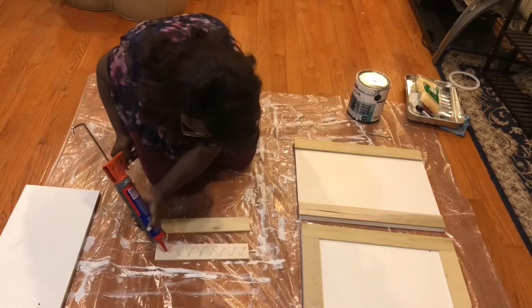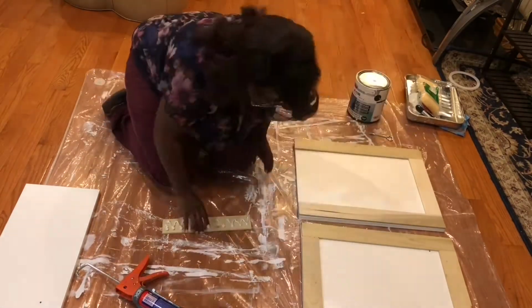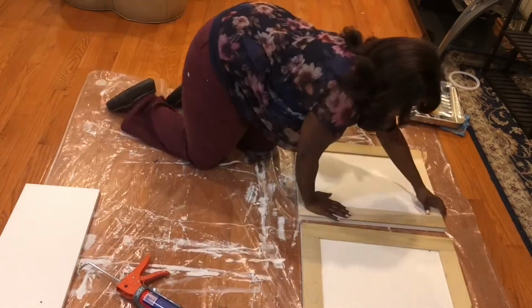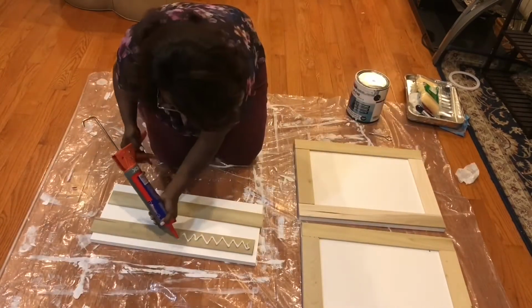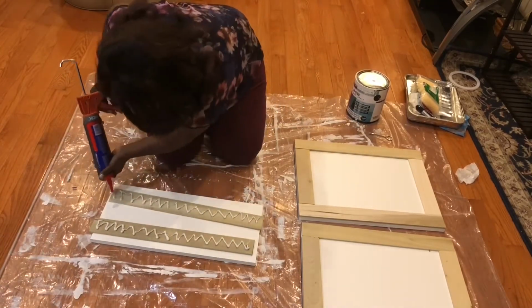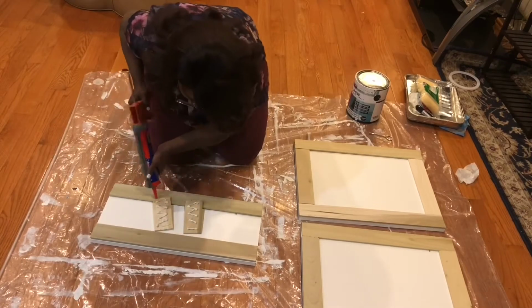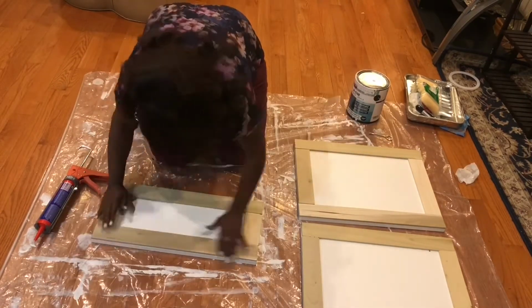I'll affix the boards to the doors and then give them a few hours to dry before sanding, caulking, and painting. A bit later, I'll actually do the caulking and then use some wood filler to soften the lines between the boards, but I didn't film that step. But you may notice the wood filler coming up in the footage where I'm sanding the boards.